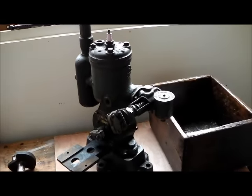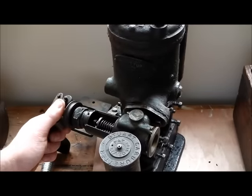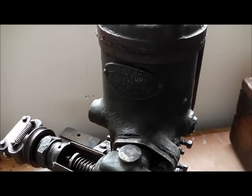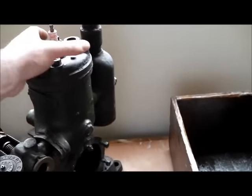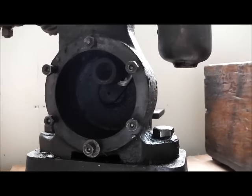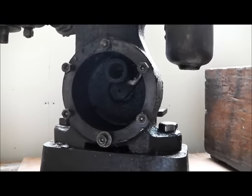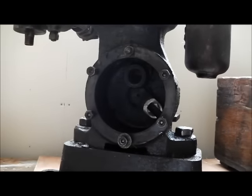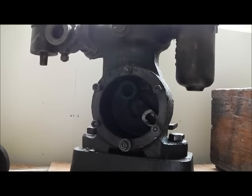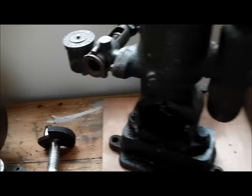The engine itself is quite an interesting thing — I haven't seen one on the rally field around here in about six years. I was quite taken with its fly ball governor, which is quite an interesting device. The engine doesn't appear to have any frost damage, not that I've found yet. It's very similar in construction to the Stuart N3, although that was a later engine, so it's interesting to see the continuation of their design. Pleasingly, this one has a bronze big-end bearing, so that's something I can tackle easily at home — I can press that out and make a new one, and I'll get a reamer of the appropriate size.